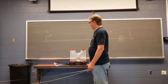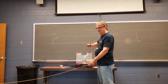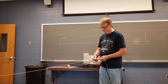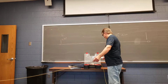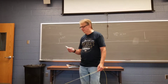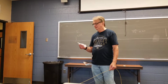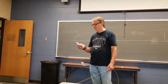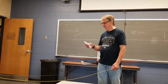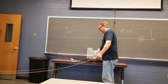I'm not doing the whole wave. You're right. I'm making a half wave dipole. Each element is a quarter wave. That's right. The overall length would be half of that 21 meters. What is the formula for making a dipole? 300 over the frequency, right? No, that's the formula for finding out the wavelength in meters, and you divide that by 2. So what am I looking for? Half wave. So I figured that wrong. 16.5 on a side? Roughly, yeah. Right, that's what I had.